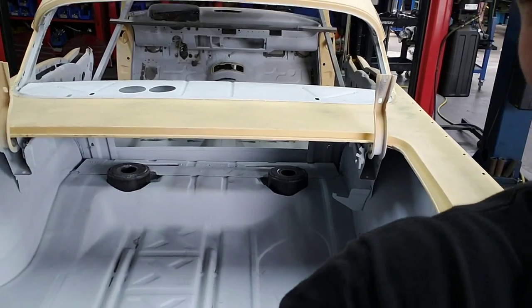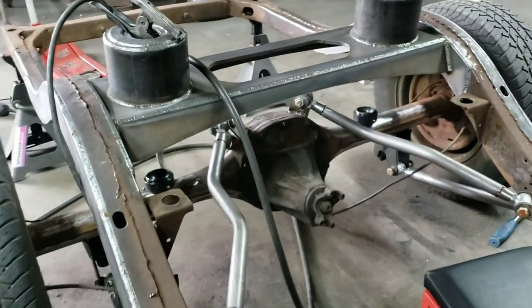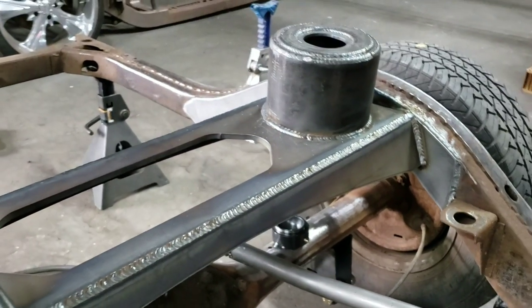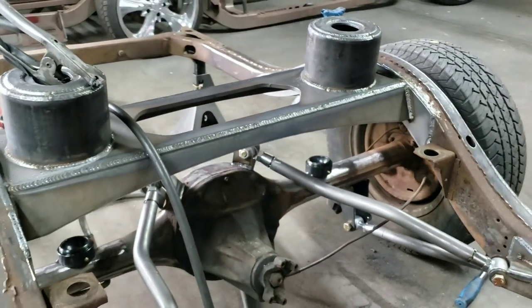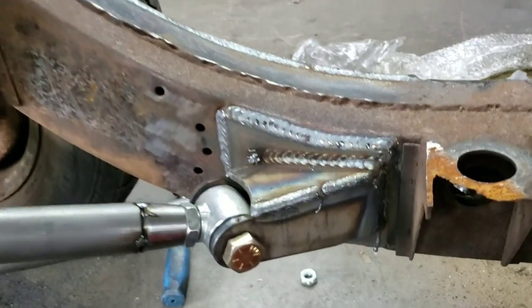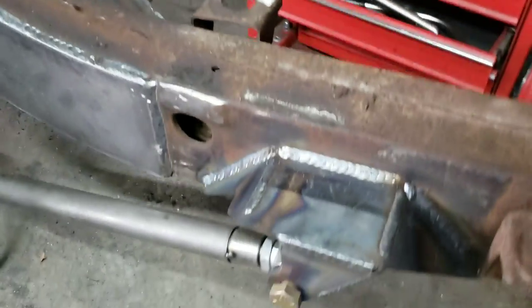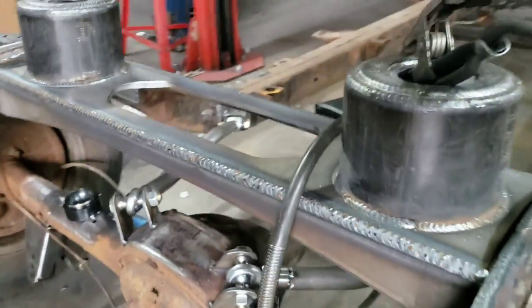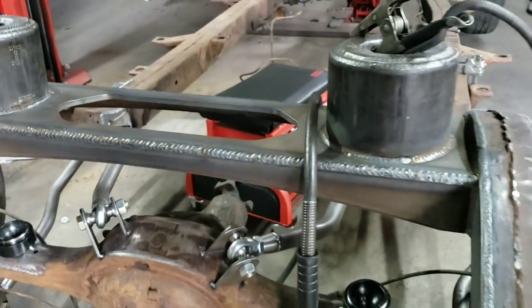That's what we call smokestacks right there. So we're moving right along on this guy. We got the bridge welded up. That's a 37 inch bead, single pass. And we got the mounts all welded up here. Just gotta come in and clean everything up. Just wire wheel it. There's not much finish work needed besides wire wheeling, cleaning off some of the little extra glass and slag.